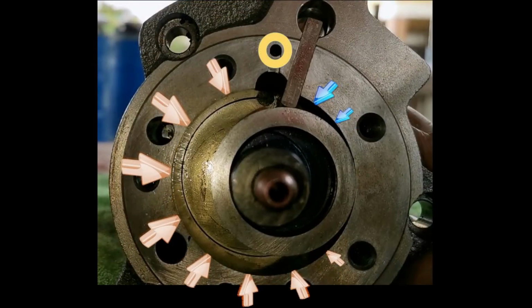Progressive rotational movements result in the rotor moving past the sliding vane, sealing off the volumetric mass and commencement of its compression for ejection through the discharge port and reed valve.